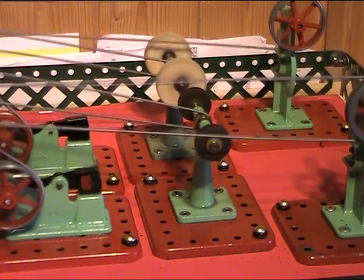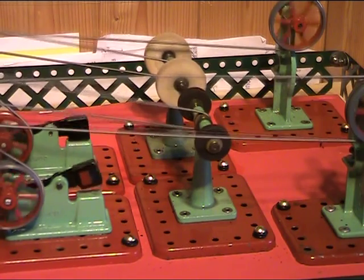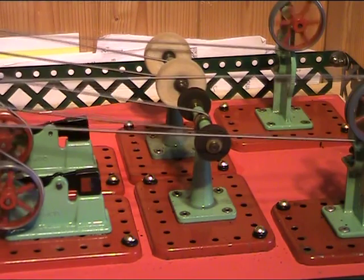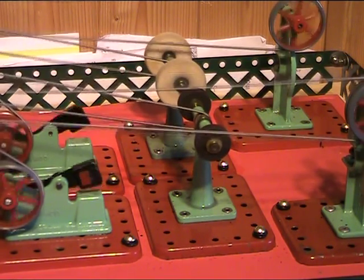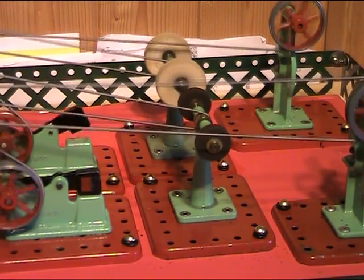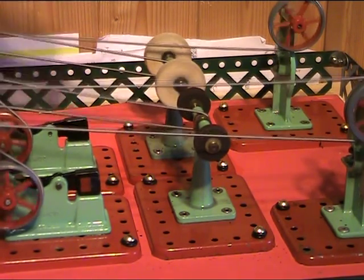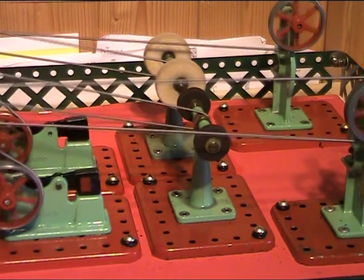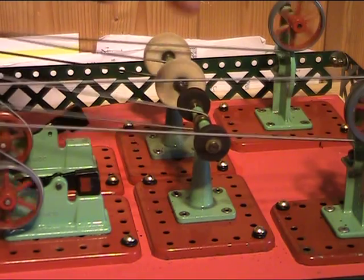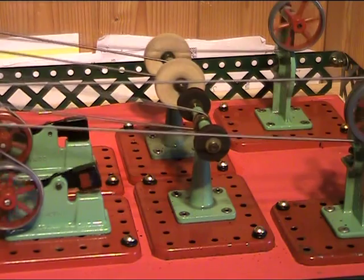There's the grinder nearest the camera and the polisher. I think I said earlier I had trouble with, I forget which one now, not spinning very freely. The one shaft was not quite pitted, but it was grubby. Bit of fine emery cloth, bit of polish, bit of lube, adjust it correctly, allowing a bit of play, and they run fine. The main problem with the polisher is there's no weight in the actual polishing mops, which doesn't help really. Even though the grinder has smaller wheels, they are quite a bit heavier and thus act as flywheels.